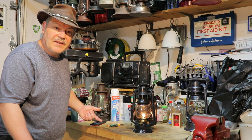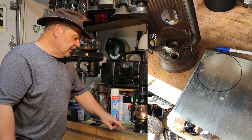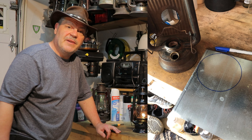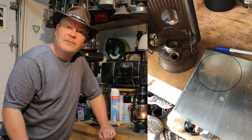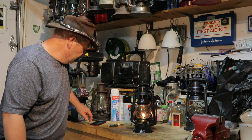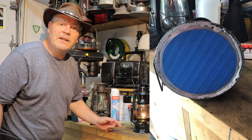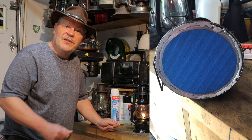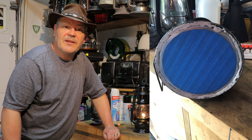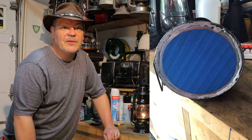Then I made a new bottom out of a piece of sheet metal. I made it a little bigger than I had to — traced it with a Sharpie, cut it out the best I could, then trimmed it as close as I could with metal shears. After that I soldered the bottom in, but I couldn't get down to really good metal, so my solder job didn't turn out for the best. Mechanically it was in there, but I knew I was still going to have a bunch of leaks.